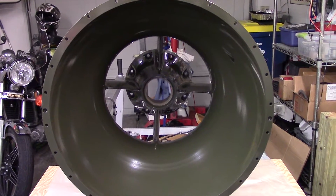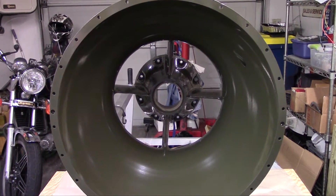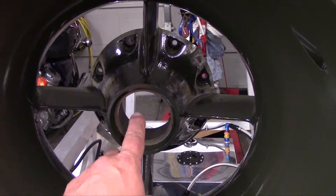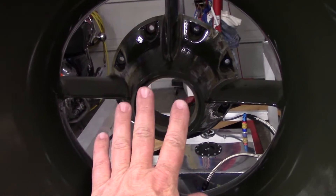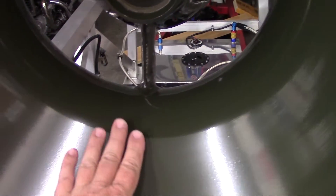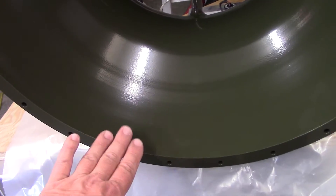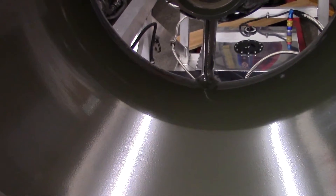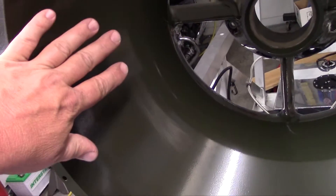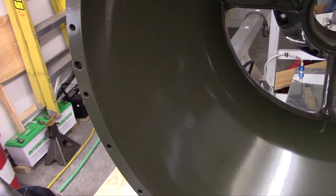This is a view from the back side of the intake and compressor housing, looking forward towards the front of the engine. Now we can see the bore here where the front bearing resides, and where the compressor inducer impeller assembly fits nicely. It fits the shape of this bell-shaped housing, and the shape of our compressor impeller blades on it are bell-shaped. This is a nice smooth surface for airflow - we draw air in here and then it's flung outward by centrifugal force from the impeller spinning the air, and then that forces it back through the diffuser.